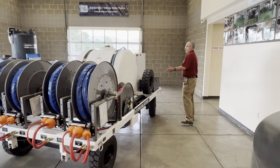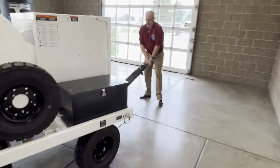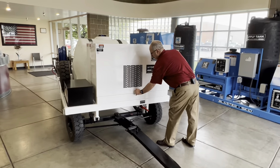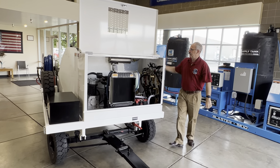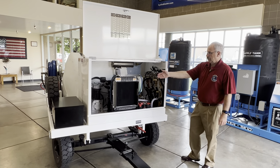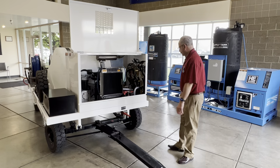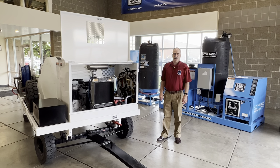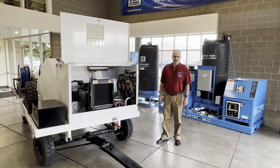Air tank. And we'll go to the business side of it. It's mounted on a heavy-duty steerable axle, which is required for flight line use. As with every Hydro Engineering trailer, it comes equipped with stays — it protects the operators when this is open, and wind won't blow it down. You have a three-cylinder, water-cooled, heavy-duty diesel engine. Everything's ready to go. This is the Turbine Engine Wash System Model 12-075-TEWS-USCG, NSN 1730-01-592-2166. Thank you.